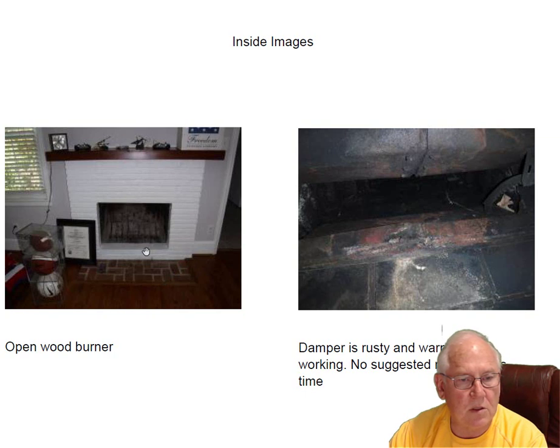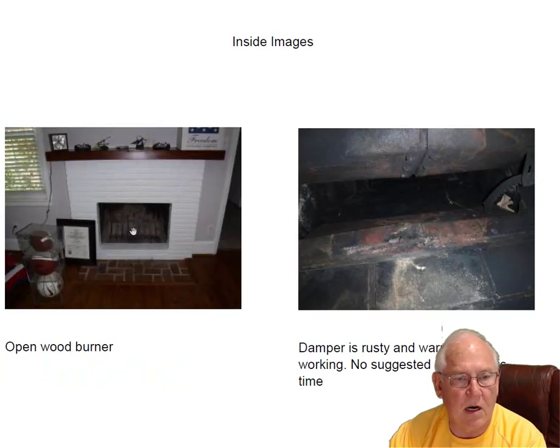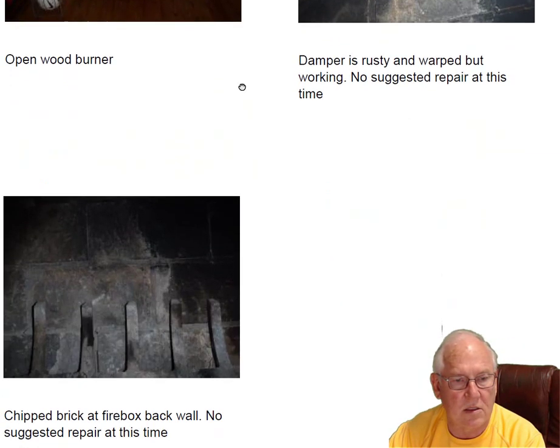Here the fireplace looks like they built the opening up a little bit — they did that to kind of picture-frame it. The mouth of the fireplace is a standard size, but the flue is an 8 by 13, which is actually too small for this size fireplace. They ended up with a ton of smoke, and before this paint went down there were probably a ton of smoke stains in the brickwork. With the picture framing we'll have to hope it works okay for your tenants to burn wood — if not, we should talk about maybe some gas logs in there.